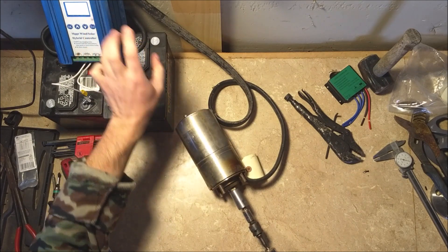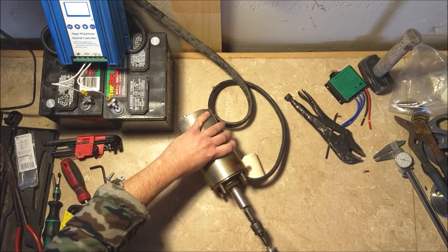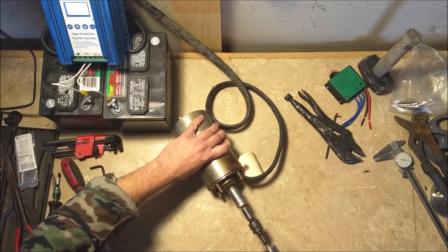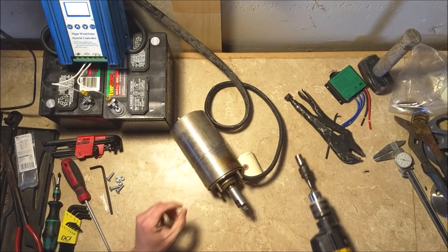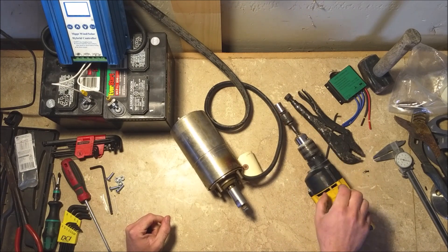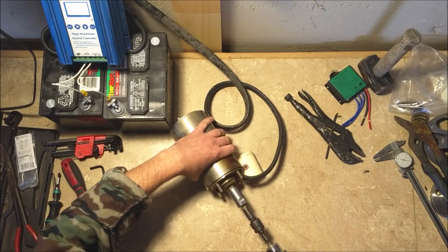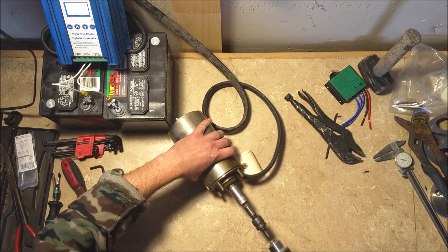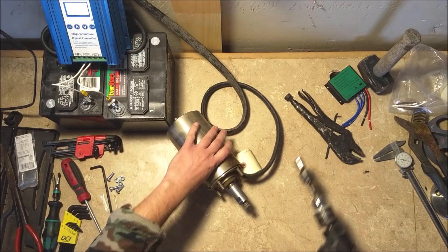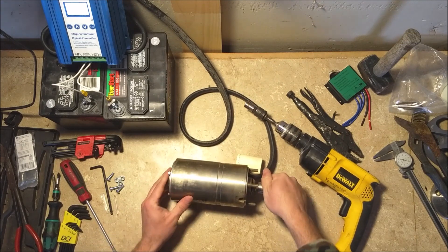Let's go ahead and hit that. 240 watts and 7 amps — that's running with this drill. The 7 amps seems to be about where this drill stops pushing. Yeah, about 240 watts, about 7 amps, and I can definitely hear it banging around on the back bearing whenever it's turning.